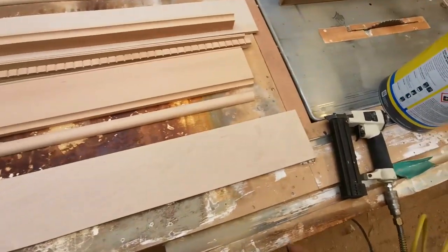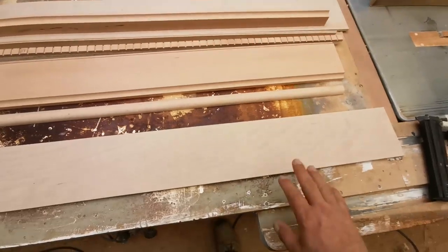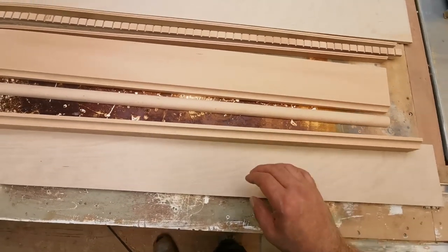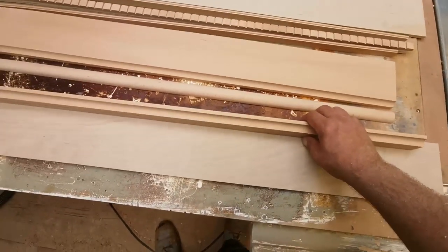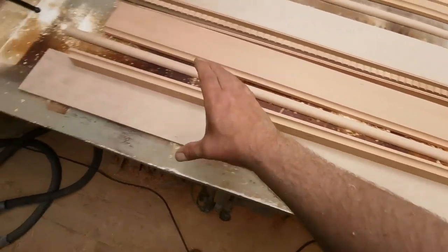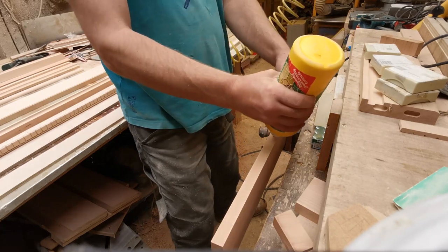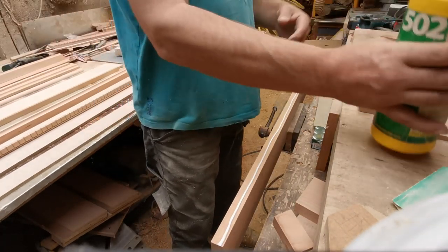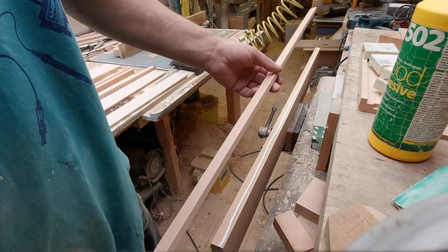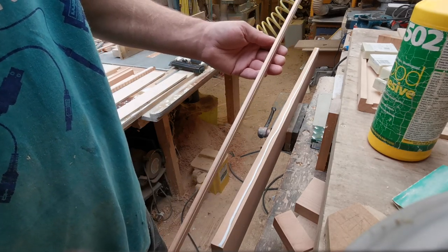Right, where to start gluing up. I've got 20mm pins in here. I don't care if they come through the other side — they're easy to pull out. I'm going to start at the top and just put a pin in here and there just to keep them in place, and I'm going to put some clamps on them. I don't want too much glue squeezing out that way, so as I put it down I'll do it this way — it'll squish out backwards and I might not get a lot to the front, but I really don't mind that.